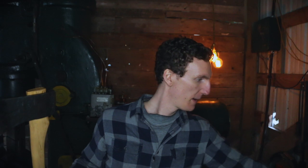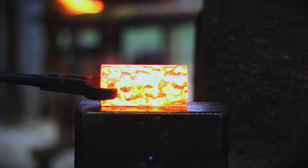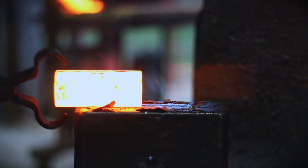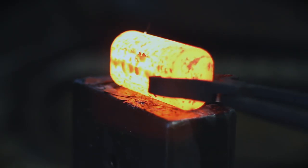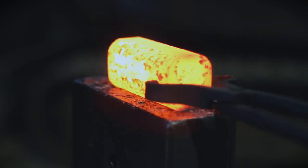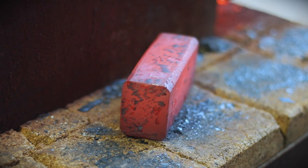Huge blade on this guy. We are gonna do some cutting — let's get that forge lit, let's go. Starting materials: two inches by five and a quarter inches long. I take that and make it rectangular. What I'm trying to do is make the width as thin as I feel comfortable running the slitter through.